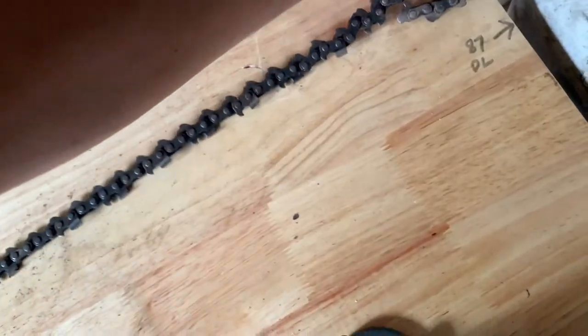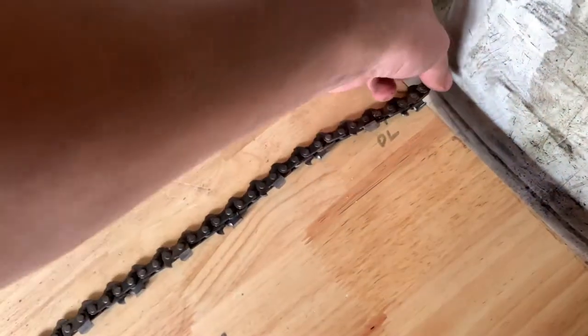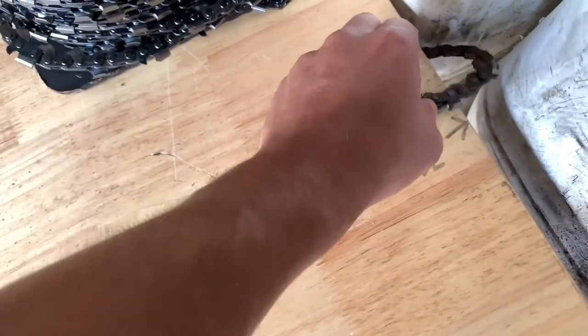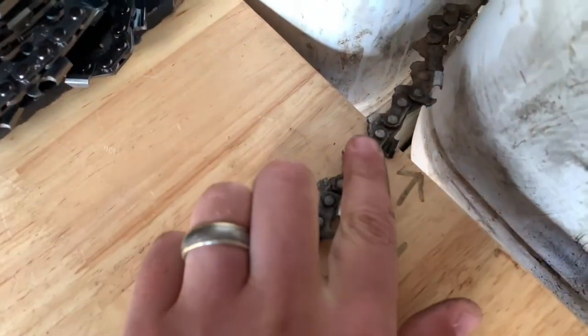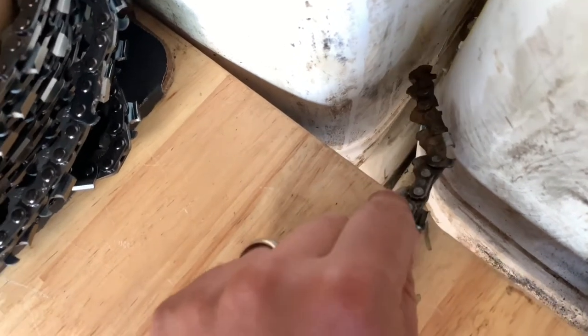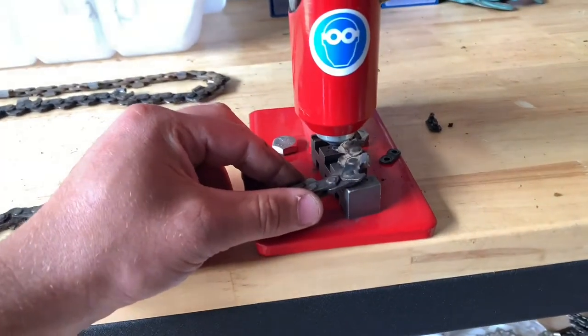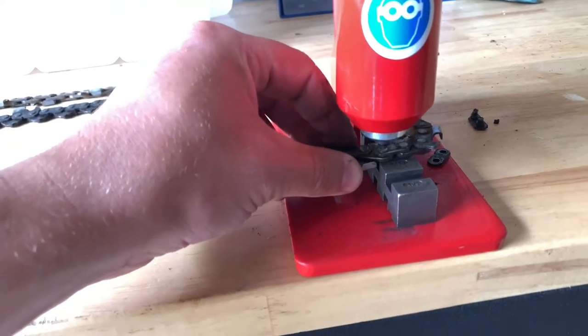What I'm doing here is these chains that I've been using — we're using them in a second thinning operation where I needed to use a bigger bar. I'm actually going to use these broken links to shorten the chain and use a smaller bar for the first thinnings. That's a cost-effective way because then I just need to put a joining link in and not new teeth. I've got my 87 drive link mark here, so I'll just need to break out this link and I'll be able to join it up.